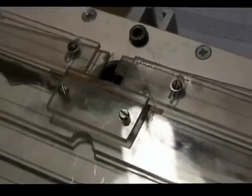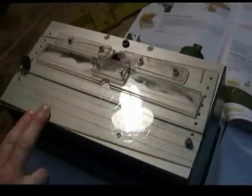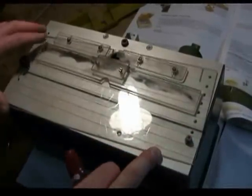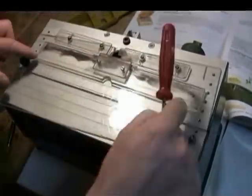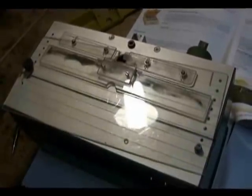So this is, he said, absolutely essential to make, because that wood needs to run through very, very smoothly. So knob here, pivoting point there, and two adjusting pieces that can be adjusted on both sides here, the straight piece there, and also a piece that applies downward pressure to the wood.